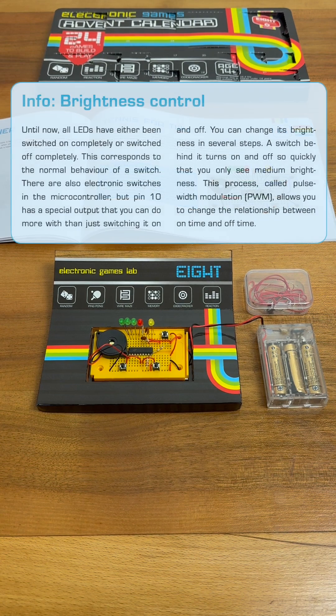So how does this work? The microcontroller is carrying out what's known as pulse width modulation. Because of the way our eyes work, if you flash an LED fast enough, the individual pulses blend together. By varying the length of the on and off cycles, or the duty cycle, you can vary the apparent brightness or intensity of the LED.